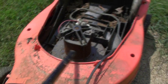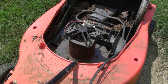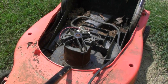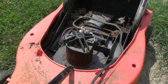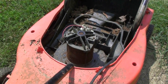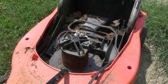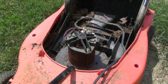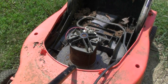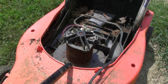All that probably is — when you release the switch, it probably shorts out the wires coming from the motor. And being that this is a DC permanent magnet motor, it's acting as a generator as it's spinning down. A short circuit would cause it to stop like that.